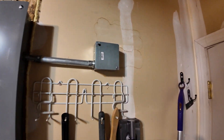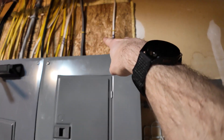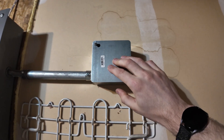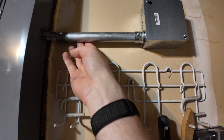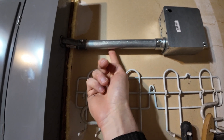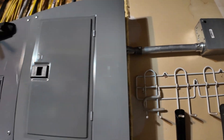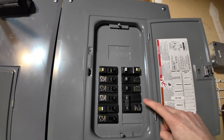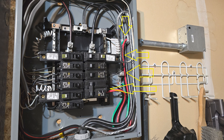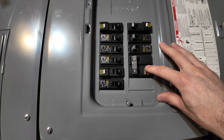Poking through the wall and coming out right next to the electrical panel — I opted to go to the side of the panel instead of above so I wasn't drilling through plywood. This is just another four-inch box with a lid and the wire literally comes out and goes sideways. We did not strap this here because it's within three feet. The box is pushed out a little bit because of the plywood, so between using a straight pipe with an offset it fit perfectly. Inside the box it goes to a 40-amp breaker. This sub-panel is on a 60-amp breaker and there isn't really anything besides a hot tub on it, so we weren't too concerned, especially where we're only doing 32 amps and only running it at night for charging.